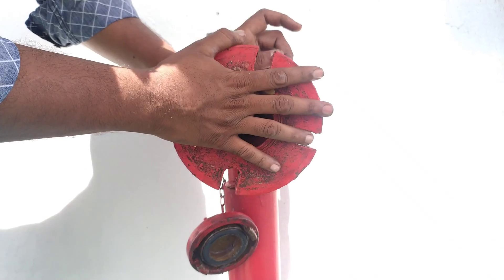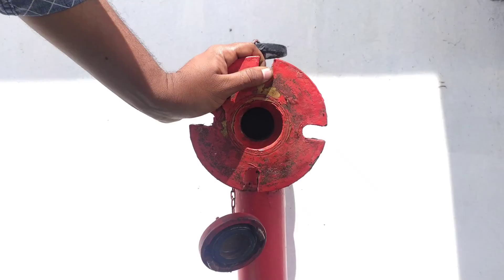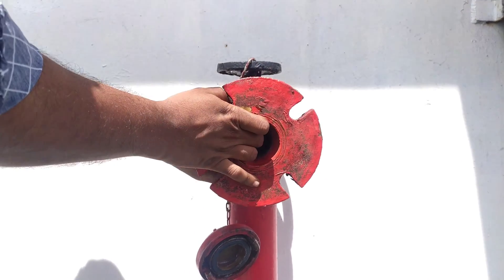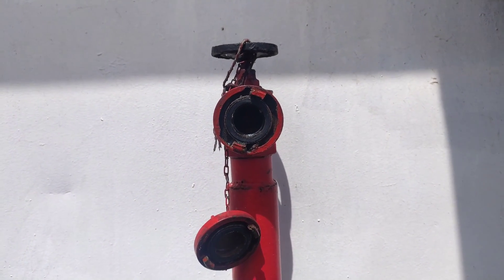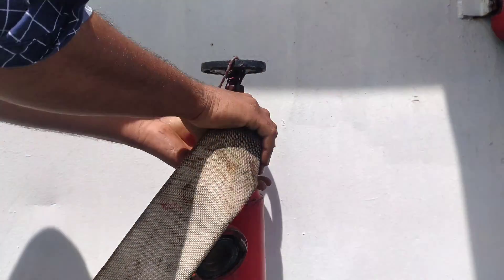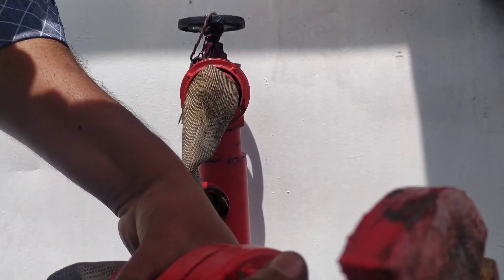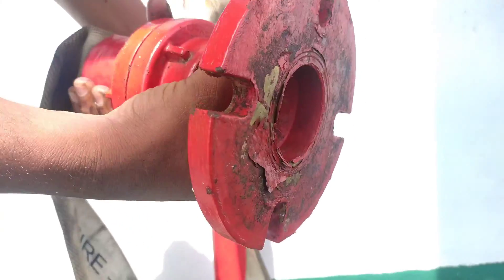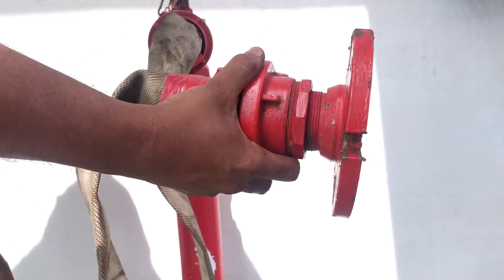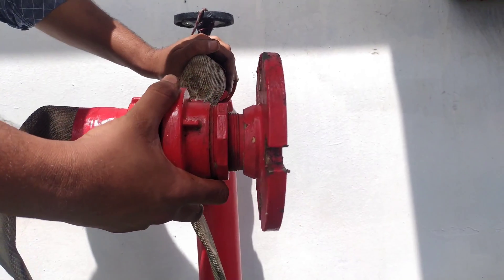When water is pumped in and our hydrant is opened, our ship's fire main gets pressurized. If the international shore connection on the port is fixed on land, we use a fire hose: connect one end to our ship's fire hydrant and the other end to the international shore connection, then take that side to land and connect it to the port's flange. Once water is pumped in and our hydrant cap is open, our fire main is charged. I hope you got a good understanding — thank you.